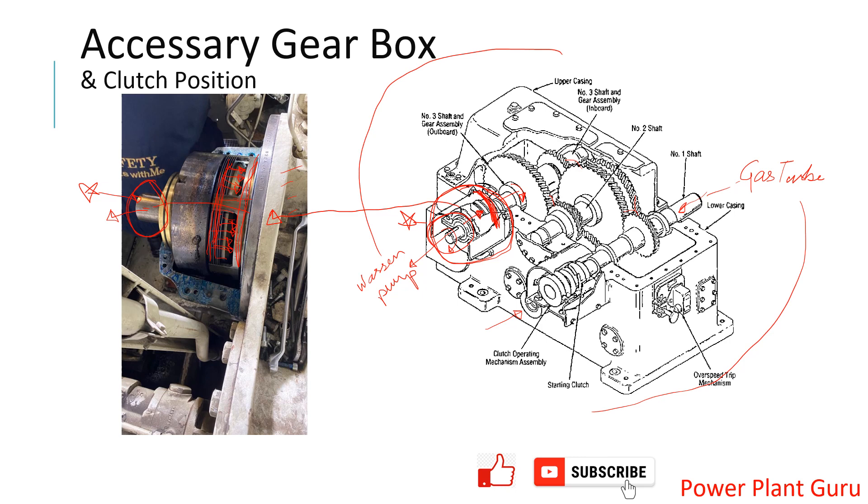When the magnetic field is created the clutch is engaged. Once you don't want to run on liquid fuel, the electrical current that creates the magnetic field is cut off. The clutch plates were held against a spring, so when there is no magnetic field, the spring action retracts the clutch plates back and they disengage.